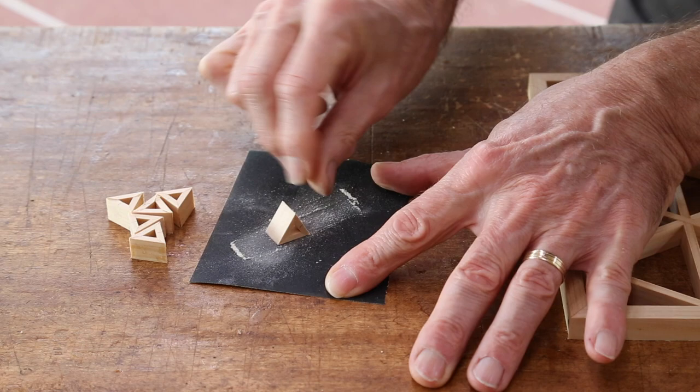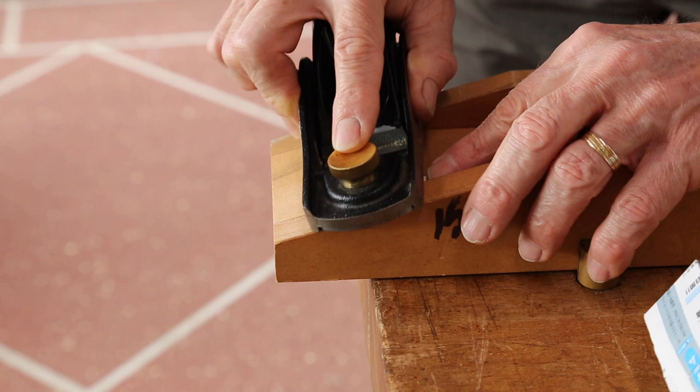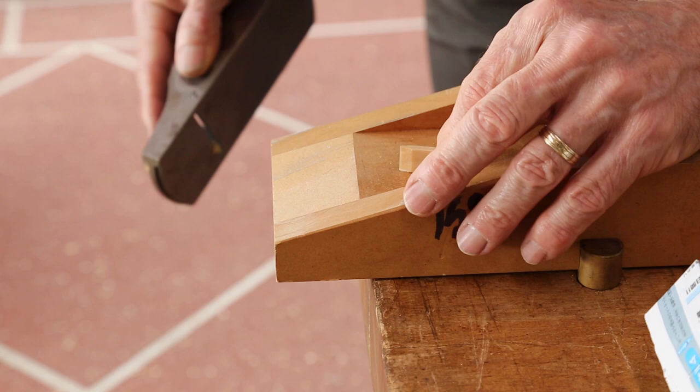Next step is to work on the hinge pieces. For this feature, you'll need 36, so rough cut about 40 pieces slightly over length to about 32mm. Start off with one jigumi triangle, so trim six hinge pieces on one end to a point on the 15 degree jig.